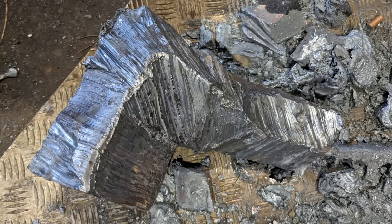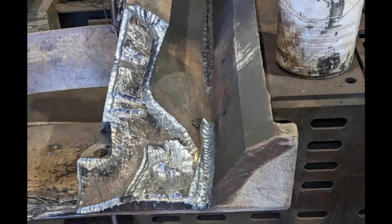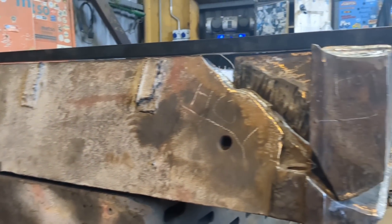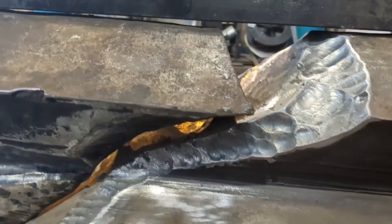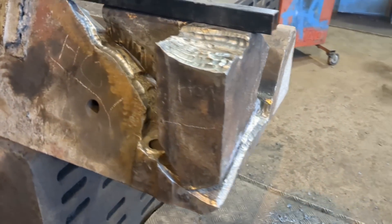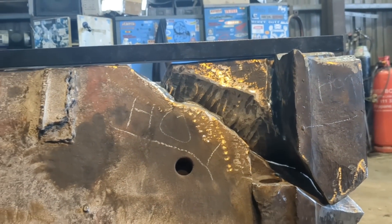I've prepped it with the ordinary oxyacetylene burners, as this is cast steel it cuts the same. Here's the other half — we'll have to gouge off all the flaws, cracks, and stretch marks on this half as well. So that's them all removed with the gouger. Now we're ready for a test fit. The whole point of leaving the peak in the middle is to retain the original dimensions, so the chalk line down the middle is the original height of the material. This keeps us within the original size and fit up.